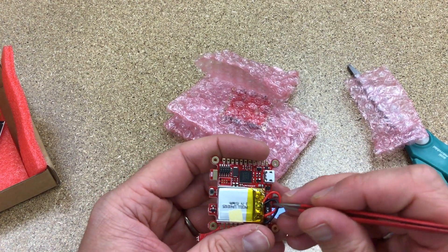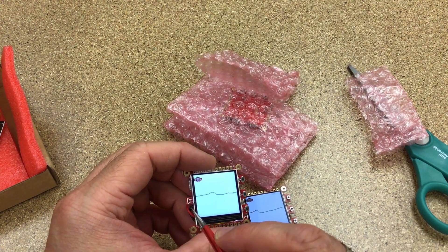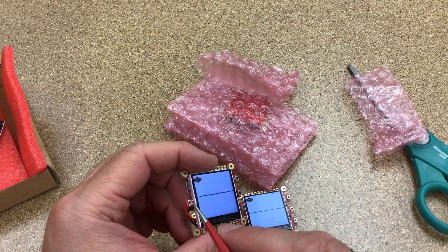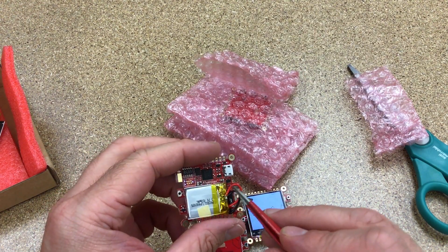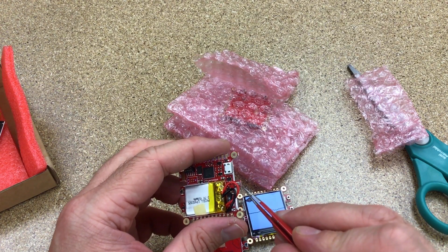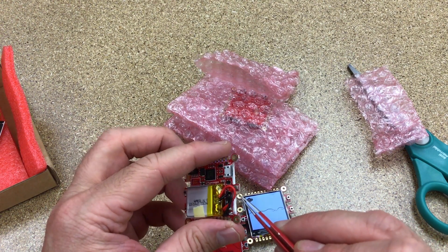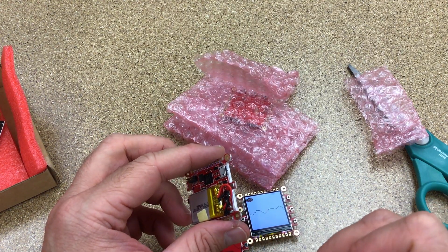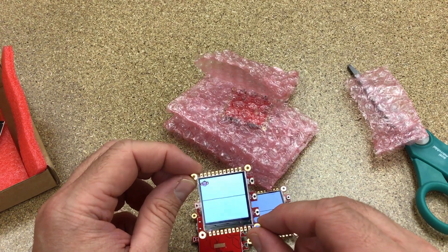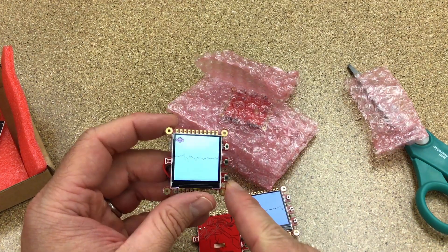Now I've got two little Mini Monkeys going. PCBNG, in addition to placing the VFBGA package, also did the hard work of putting on the bottom port MEMS microphone in a land grid array style package. These are fairly sensitive — you can't really clean them and you have to be careful with handling because you effectively have exposed silicon through that port. They did the hard work of placing the device and performing x-ray inspection. I've seen enough MEMS microphones fail due to mishandling during soldering, and these turned out great — kudos to PCBNG.